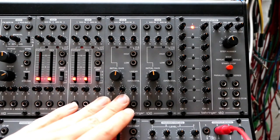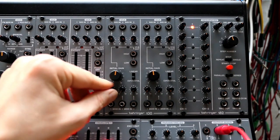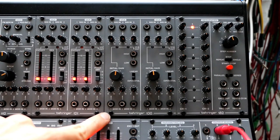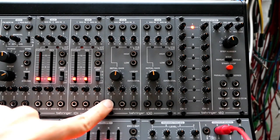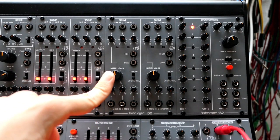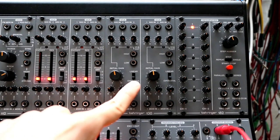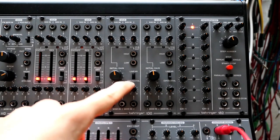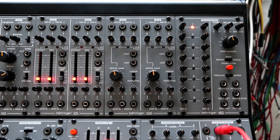On top of this manual setting come three CV inputs, all with their own attenuator, so this is actually a CV mixer here like we had in the filter module. And with these CV inputs, on top of the maximal initial gain, we can achieve a gain of about 1.5, which is the maximal gain for this VCA. Here we can select between linear and exponential response, and we already heard the results of these settings earlier.